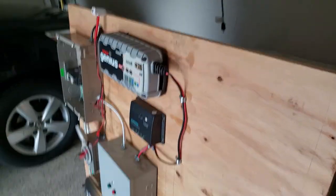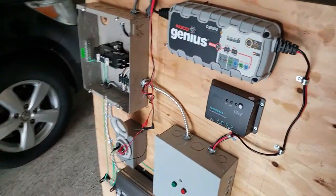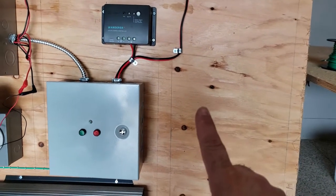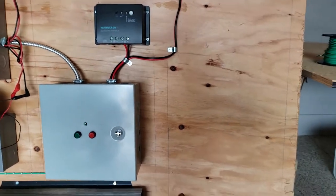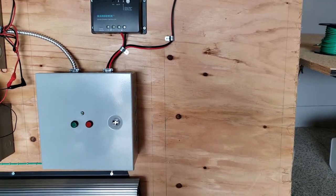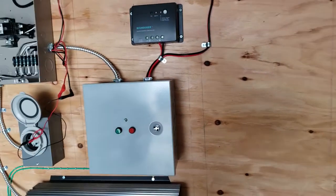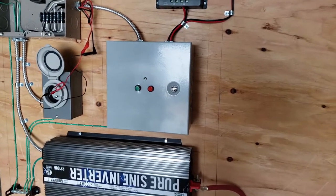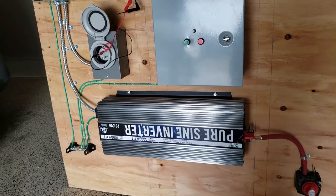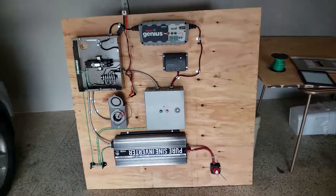I did draw this out beforehand in OneNote and moved all the parts around to make the wiring efficient without crisscrossing. Right here I'm putting a little project box that will have three voltmeters with momentary buttons next to each one. She can press one to see the battery voltage, and I'll give her thresholds so she knows if she needs to run the generator. Another will show the solar panel output so she can see what the panels are producing. The last one would be AC voltage — I noticed the inverter puts out a rock-steady 117 volts regardless of whether it's powered by one battery, four batteries, or even a small jump starter during testing.